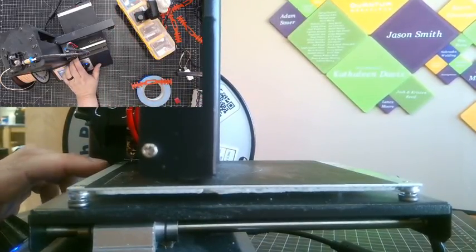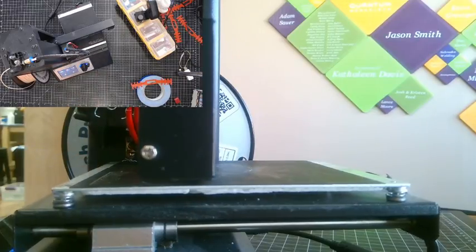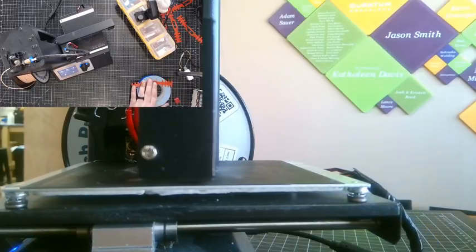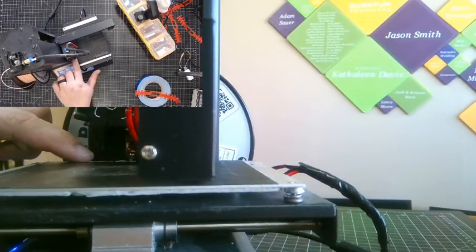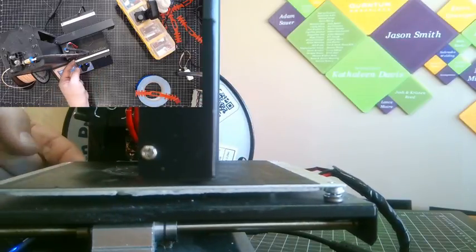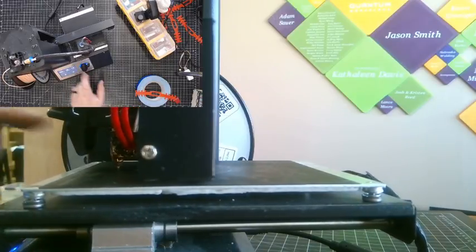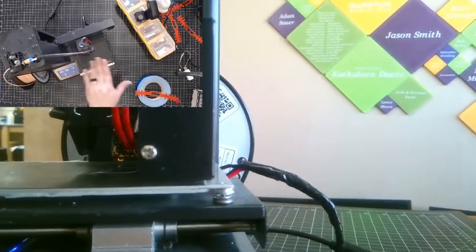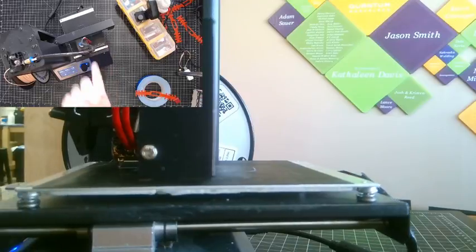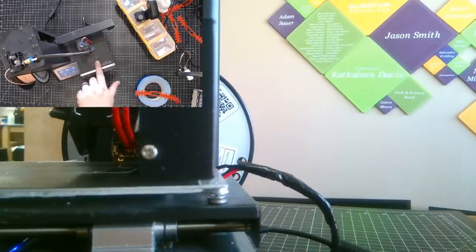So first it has to take the nozzle and it has to find the zero, find the home. So everything has a home. You know, ET, phone home, same sort of principle. But what it's doing is it's actually taking the nozzle now and it's drawing a path here to there. And once it's drawn its path, yep, that's perfect. It's going to make the outline, which in 3D printing terms, that's called the skirt. That's the little line around it, because that's just something where it says this is the border within which I'm going to print.